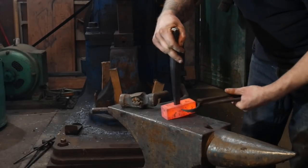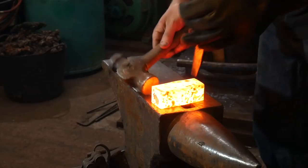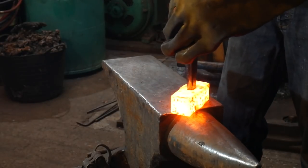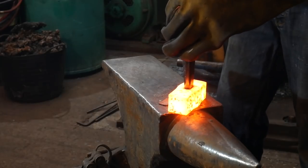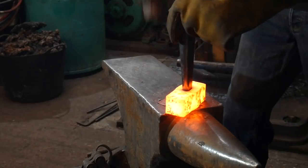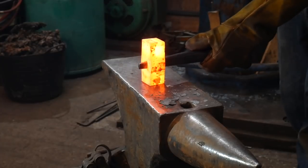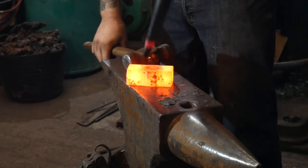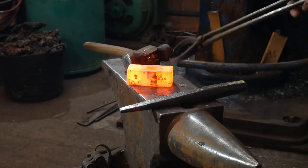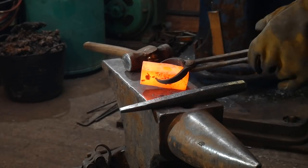We're probably okay to start using that hammer eye drift now. If I was using this as a hammer eye punch I would glove my hand and do it very similarly — that's all the way through now. Because the hammer eye punch is a hell of a lot meatier, we can get it in there, get a considerable amount of work done, and get it out without causing too many problems. It's soaked up some heat but hasn't caused much of a problem. That's our hammer eye just there. I'd do the other side normally but from this point on I'm going to leave it, because this is basically your hammer eye.